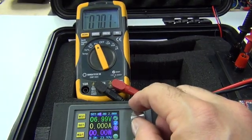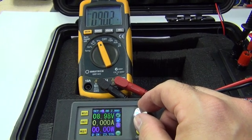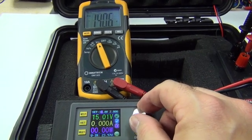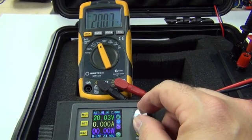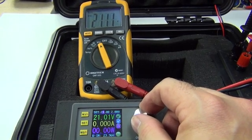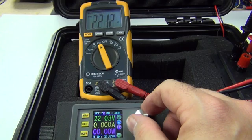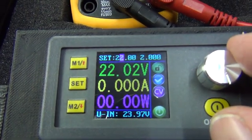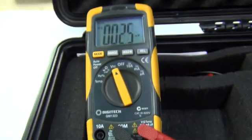The module is controlled by a knob at the front which is also a push knob to cycle through the individual settings. You don't just dial from 0 to the maximum voltage — you can pick each individual column, so the tens of volts, the individual volts, to select the exact voltage you want before turning the device on. Once on, you can head back into those settings and adjust the voltage accordingly. The back of the device has a fan, so if it gets too hot when pushing close to its 2 amp limit, the fan will kick in and keep the unit cool.